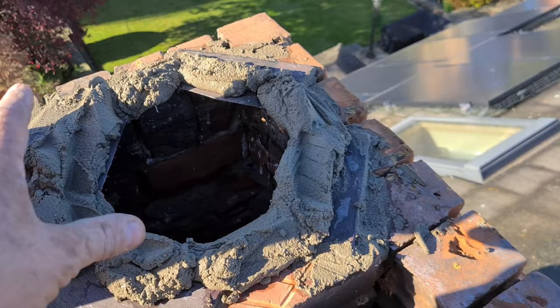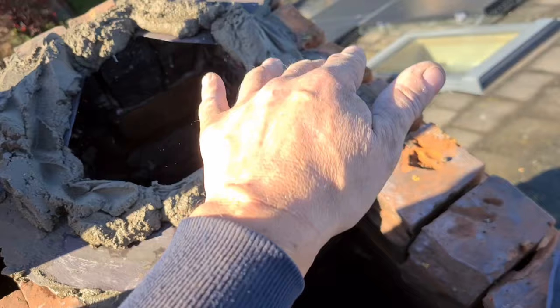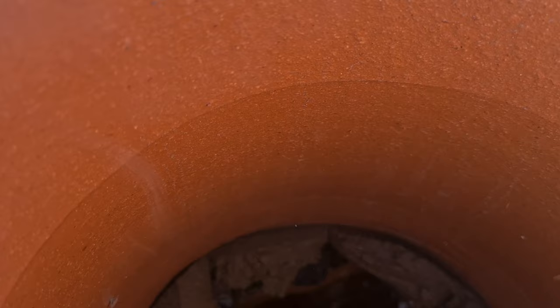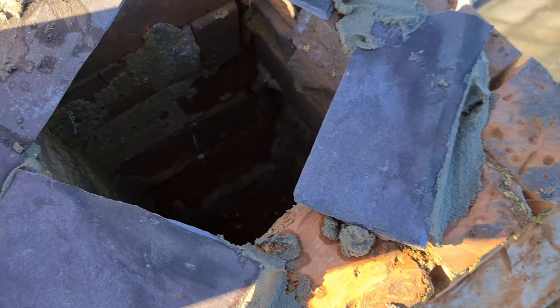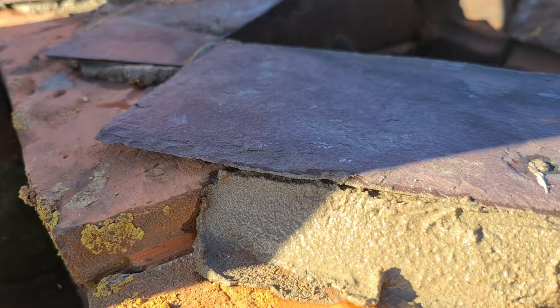Once that's done, we'll do the second one before we haunch it up all the way around. You've got to have something to stick to — you can't just expect the haunching to hold it in place. So I'm going to put that in place now, and as if by magic it's bedded on. What we need to do is just clean the rags off — we'll neaten them up because we don't want anything falling down the flue. This is secure — well, not fully haunched yet, but it's bedded on. I've tucked these under here so it's all going to bond together.